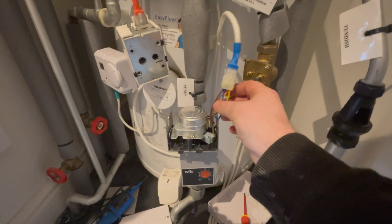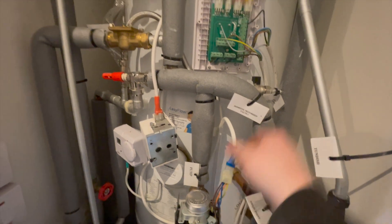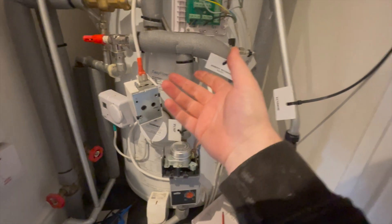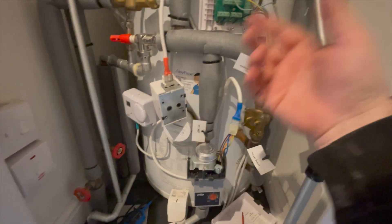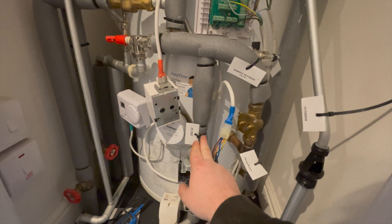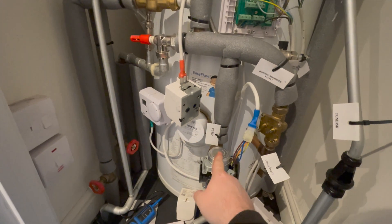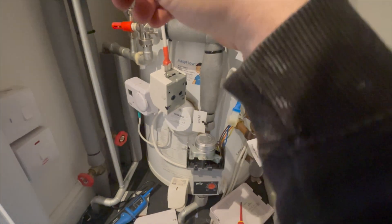On these ESI units, instead of having to wire everything up you just have these little connectors. The good thing is it's easy to wire - you literally just unclip them. The downside is you're tied into this ecosystem, so you can't just pick up a Honeywell or Drayton valve - you have to order the specific part. To test it's working, we've switched the two valves around, and one still does the same thing while the other works. So we know it's not the circuit board or the stack downstairs - it has to be that valve.